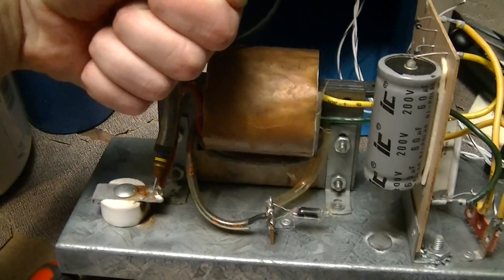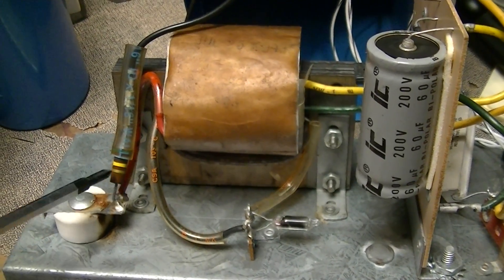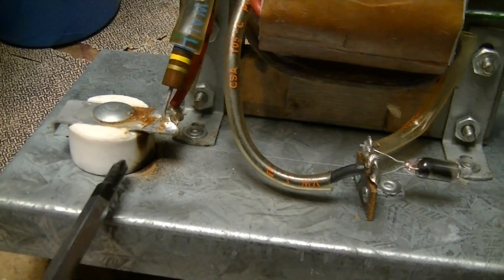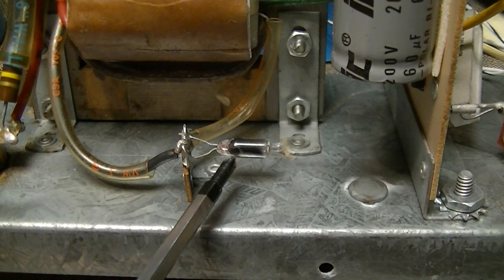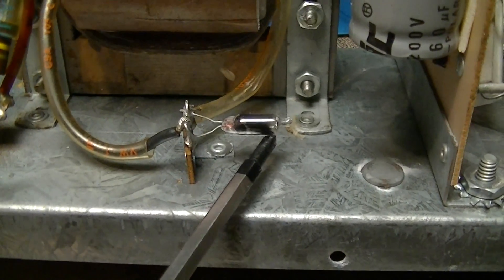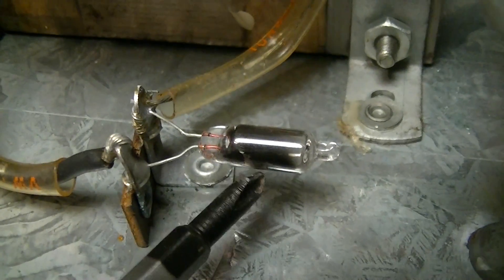This, for perspective of my fist, is big. And there's this which is the current limiting resistor for the front panel indicator lamp — as you can see, it says it needs an external resistor, because otherwise if you hook that up directly to mains it would pop instantly. The ceramic bushing insulator for the output. And this neon lamp, which I presume is for some kind of transient limitation in the event of a short-circuited output.